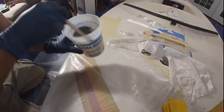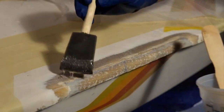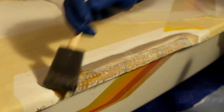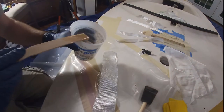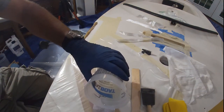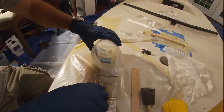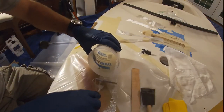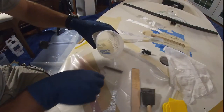That's about two minutes, so I'm about ready to go. The first thing I'm going to do is just brush some straight epoxy onto the area that I'm treating, just to make sure it's really well wetted out and really filled in. When you're laying up a couple layers of epoxy like this, there are a few ways to do it. You can just lay them up onto the hull and work your way up that way. I'm going to lay them all up on top of each other over here and work them all together, then put them all on together at once. I do need to be a little careful to get enough epoxy onto that bottom layer to make sure I get a really good bond into the hull between the bottom layer and the hull itself.